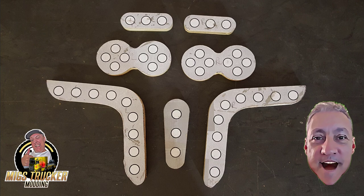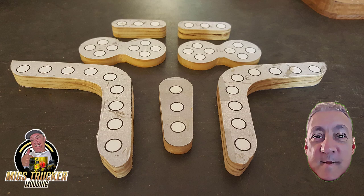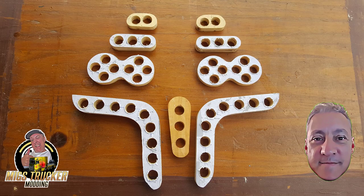The next step is making the button holders. As shown in the picture, using a center punch find the centers of each hole and punch a guide to mark each hole according to the dimensions of your push button switches, so that it looks like this.